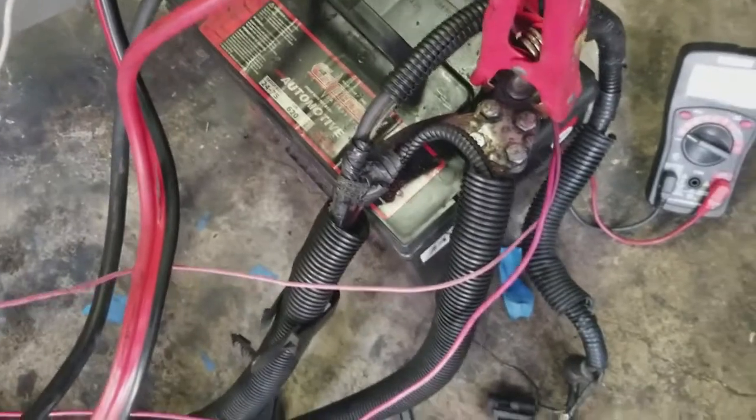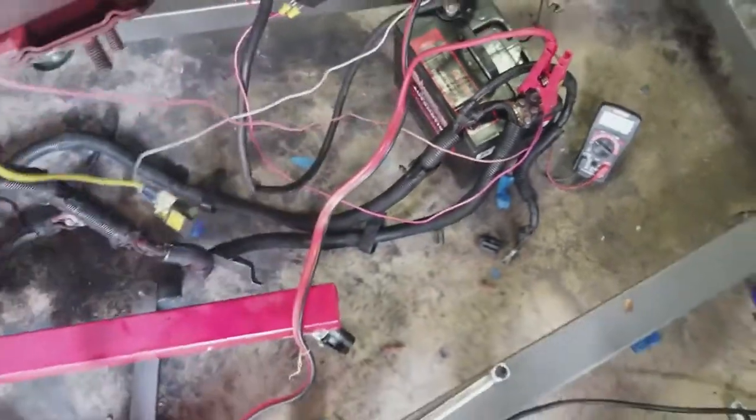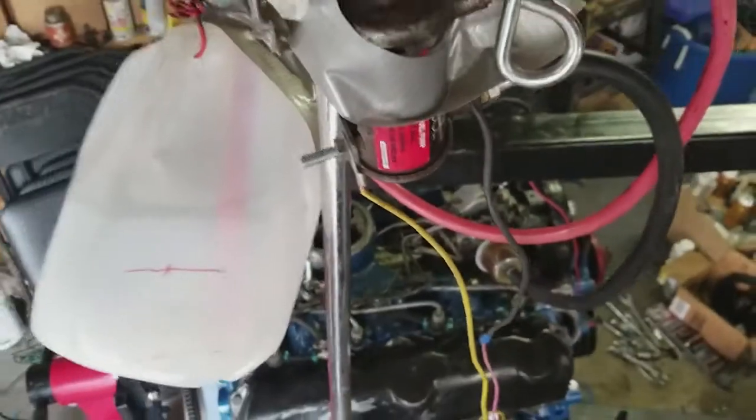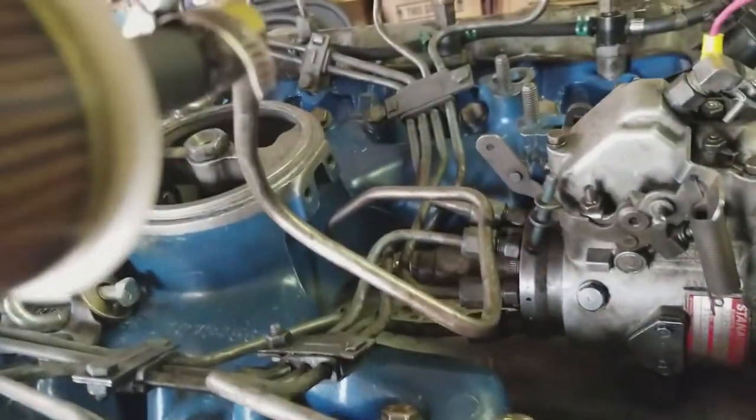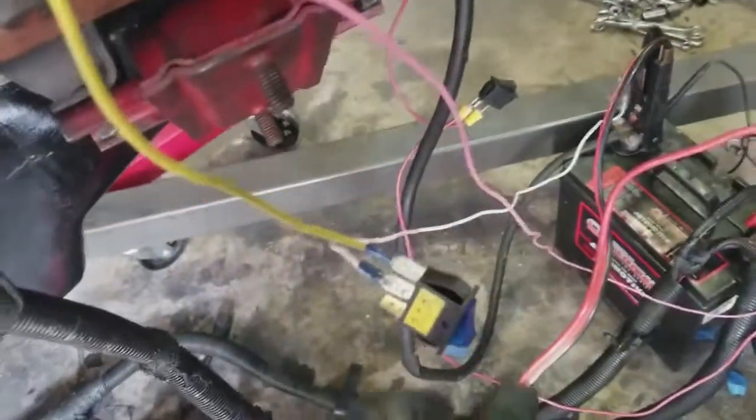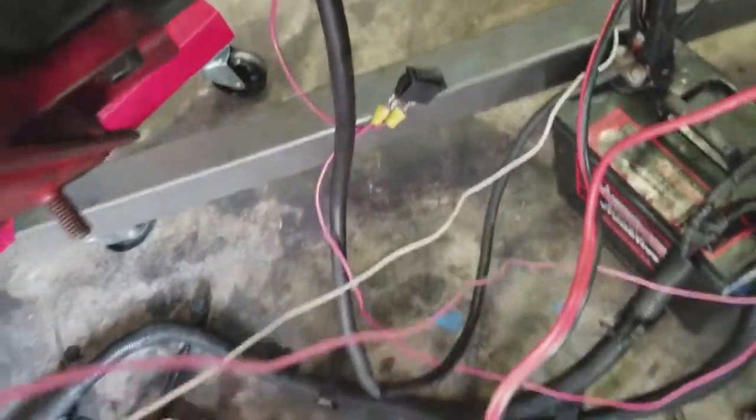The switch is just jammed into the positive side of the battery. I also have a jug with a little bit of diesel — I've run it already so there's only a little bit of fuel left. That fuel goes to a fuel pump, which goes down to a filter, and that goes into the IP hose here. The filter just stops any particles that might be in the fuel. The wiring for the fuel pump goes down to a switch, so I've got two switches: one for the fuel pump and one for the fuel solenoid.